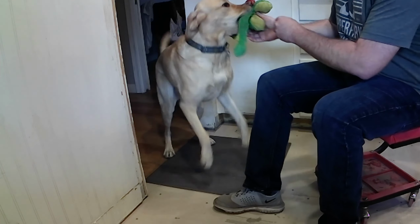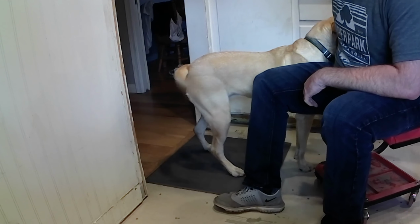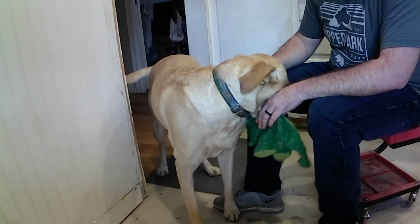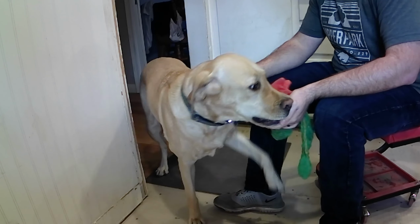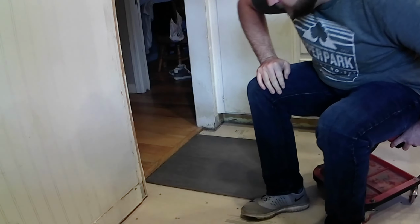I know, I see it. I have a little template made to follow the cabinet line, and my depth is right. There was 3/4 inch subfloor, and then thin set, and then Hardie, and Hardie screws, so it's a pretty solid floor and it comes out just right.